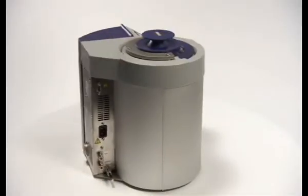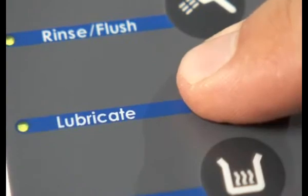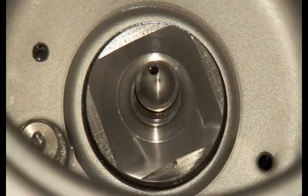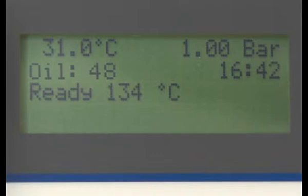To check the oil function on a DAC Universal with a serial number higher than 104,000, keep the lubricate button pressed. After a few seconds, you will hear the oil dispenser start pumping, and shortly after, oil will enter the chamber from the bottom adapter. When this happens, immediately stop pressing the lubricate button. The display of the DAC Universal will now indicate the number of shots from the oil dispenser. If this number is 60 or above, or if no oil enters the chamber at all, please call your supplier. The oil indication will automatically disappear from the display after a few moments.